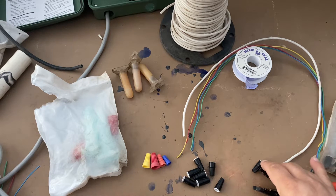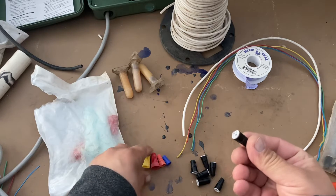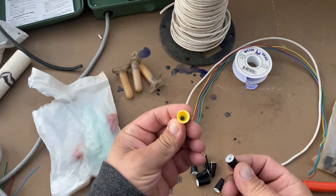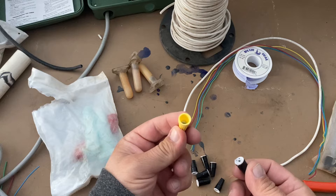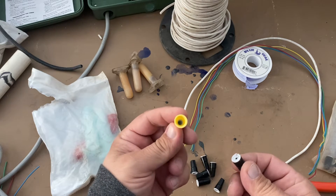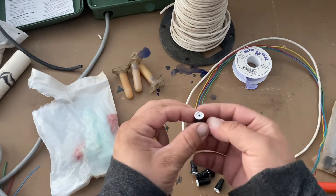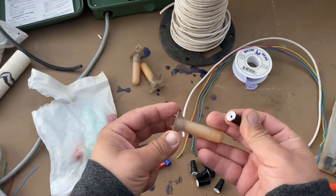Just a quick explanation for wiring and wire connectors for sprinklers. Standard wire nuts are fine if you have a box that is sealed or you're indoors. Since it's low voltage, these are perfectly okay. But if you get outside or in a sprinkler box — out in the elements — you need something that's going to seal up, because you don't want to get water into the wiring.